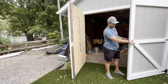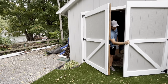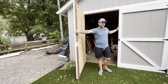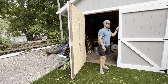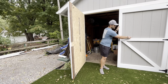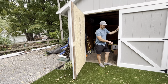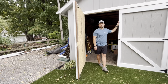Handle-wise, this shed door handle works really nice. As you can see, it closes into this little gap behind here and locks as well — you open and close it and it latches nice and tight against the door that's fastened in. One additional thing I did was use exterior caulking and caulked all the edges of the material to help with water penetration. It's all treated so it's not a huge deal if you don't want to do that. But these panels have gaps where water can run down and out, and I didn't want water pooling against the bottom of the shed floor and causing moisture issues, so I wanted to seal everything up.